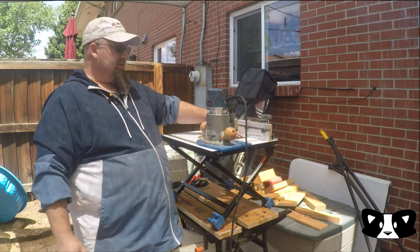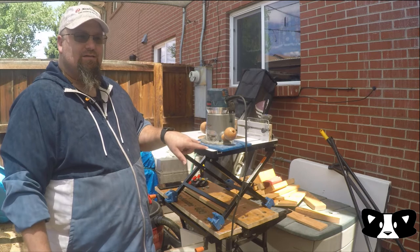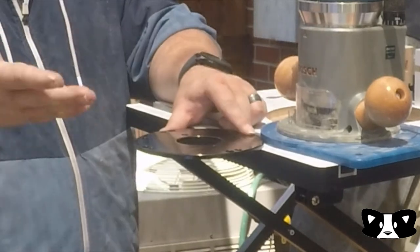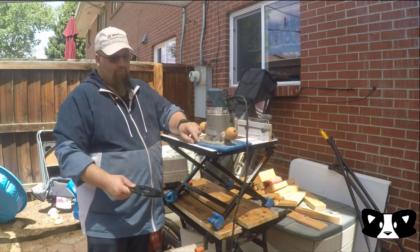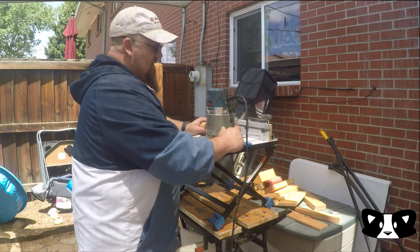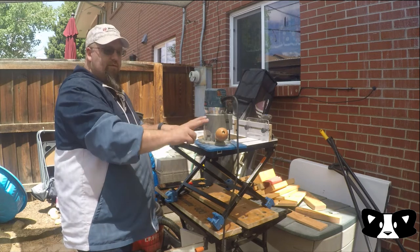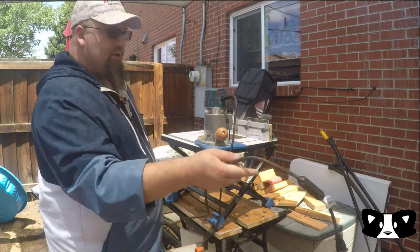The rest of this plate is basically what sets it inside here. A salesman at Rockler told me that this collectively is the same thickness as the standard plate. I have a Bosch 1617 medium router — unfortunately, he lied. This is literally half the thickness of that. It's not a big deal, but just understand: if they tell you the stock plate is the same thickness as the router plate, that's only true if you count just one piece. The idea is I could take this in and out to go from a handheld router directly into a table router position. The reason it's sold separately is because the table is one item and the plate is either for small or medium routers — they don't make them for big routers like the huge Makitas or Tritons.